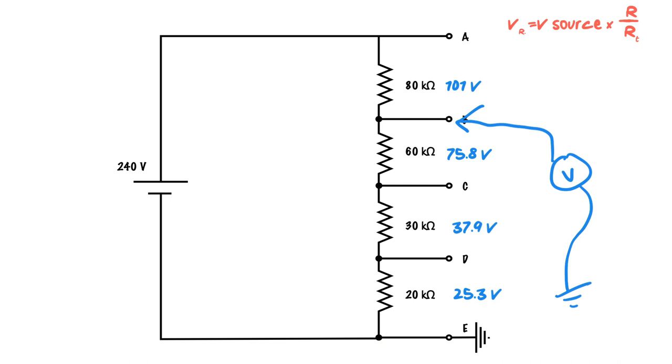And we could do the same thing here. If we wanted to move this lead here, let me just erase this. If I wanted to move this lead and change that down to this point, to there, I would just be adding up this voltage and this voltage. So we do that and we're getting our volt drops across there. Let me just get rid of my beautiful drawing of a, one second here, will not erase for me.